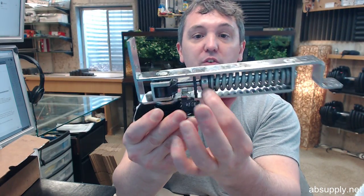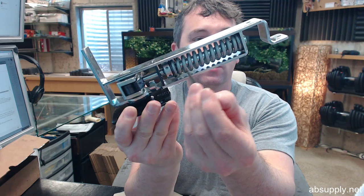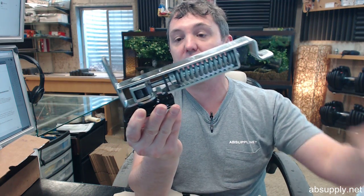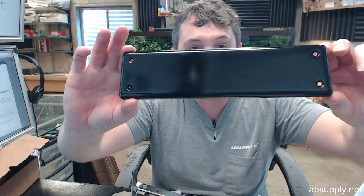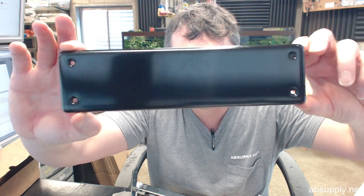Controllable spring. You've got this tension collar that's there, and indeed a tension rod is included where you can set the tension by inserting it there and turning it clockwise or counterclockwise. Okay. The 601, that means bright black japanned. Bright black japanned, and this will be available in all of the common finishes. Prime coat, 600 bright black japanned to 601. 603 is zinc. Your brass, your bronze, your chromes, your polished, your satin, your oil rubbed bronze.